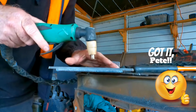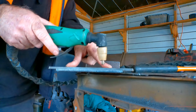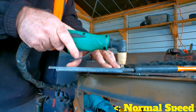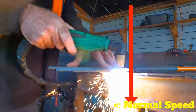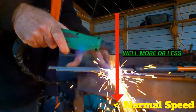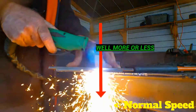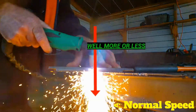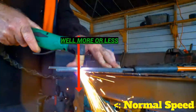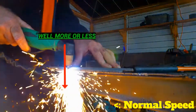Watch this — this is quite hard for me because I've got it set in the brain what speed to cut. You get that after you've been plasma cutting for a while; you start to know these things. Watch where the sparks are going — the sparks should be going straight up and down. See that guys? Sparks straight up and down. So we're cutting at the right speed for the torch and the cutter can handle it just like that.